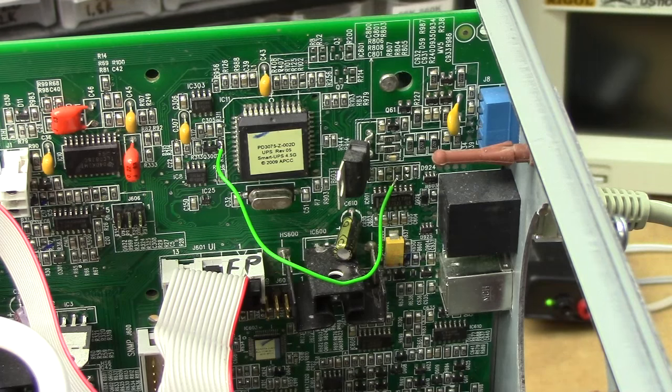What I've done right now is just a bit of a proof of concept. I've disconnected the communications processor entirely, and I've just connected the main UPS processor straight onto the MAX232 level converter which is already present on the main board of the UPS. If I just hook it into my lab computer, I can operate the UPS perfectly, even from a completely turned off state.